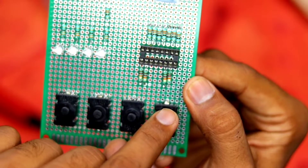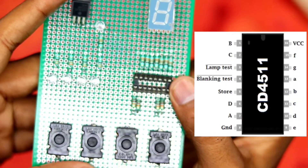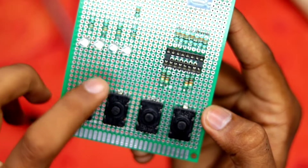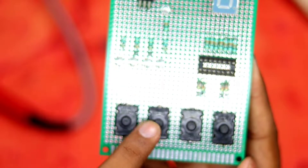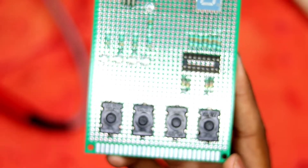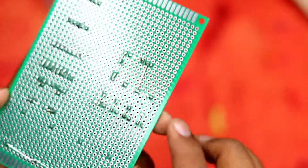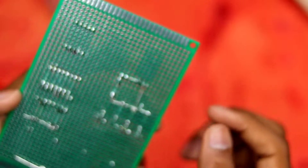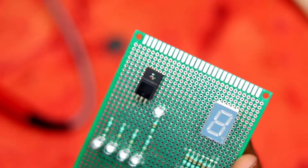The only thing left is connecting the switch pins to the LEDs and to the IC. This pin connects to input A (or A0) of the IC — check the datasheet to confirm pin assignments. BCD is laid out from right to left, so each switch connects in parallel to its corresponding LED. There's also a nice space left on the board where I can mount the 9-volt battery and add a switch on the solder pads for easy power on/off.